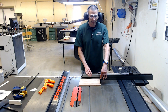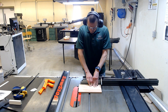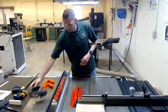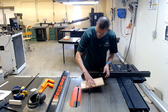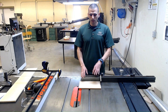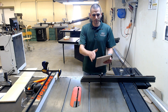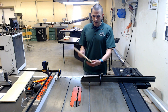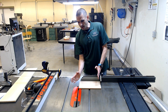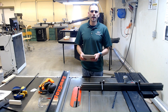I'm going to press the stock lightly against the stop lock and then push it down and just slide gently across. I'll wait for it to slow down all the way. So now it's finished cutting. I'll just double check my measurement before I make a lot of cuts. It looks like I'm visually right at 11 and 3 quarters. Once you have the cross-cut sled set up and you think it's perpendicular, you can make a cut and make sure you remember which edge was being referenced as you made the cuts. I'm going to take it over to the height gauges, stand it up and measure it. You can also sketch them on the part and then you can see if it's angled outward or angled inward — that'll help you correct this.